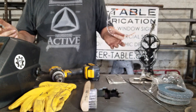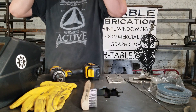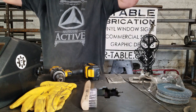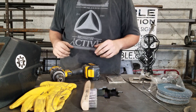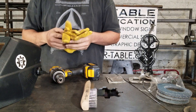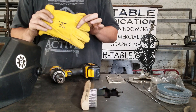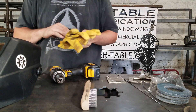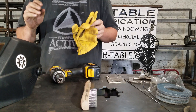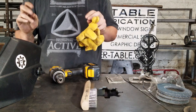The first thing we're going to go into is what you need to get started. Obviously we're in a shop, so we need safety glasses at all times. Really no excuse not to have your safety stuff on. You're going to need a pair of nice leather gloves — you don't need anything big and heavy. These are actually a little bit thick for TIG welding. You want some nice thin leather gloves so you have a lot of dexterity with your hands. Basically you want to be able to feel stuff and move your hands really well.